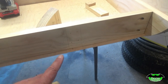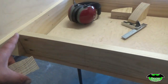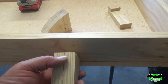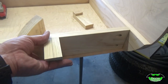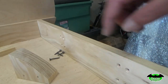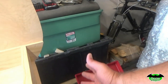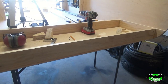I have all my blocks cut. I came over nine inches on center — nine inches, nine inches, nine inches — and it's nine inches from here to center. I've already pre-drilled and countersunk some holes. I'll put some glue on here, set that in place, clamp it, and fasten it with some screws, and that won't be going anywhere. On the inside I'm going to use four screws on each one, so I get a nice good connection so when I bend my wood and my fill line around, it has something to attach to and won't be flapping in the wind.